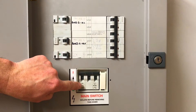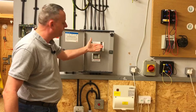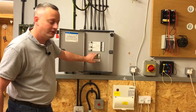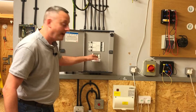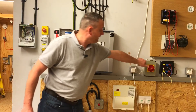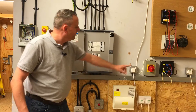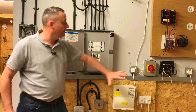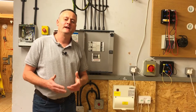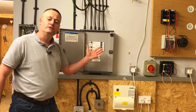We're going to turn off individual circuit breakers, reducing the current down so that when the main switch isolates, we expect current to be zero. We've turned off all of the devices within the distribution board, then we throw the main switch off-load — so there's no current going through it. As we have a remote switch away from the distribution board, we can turn that one off as well, and that's the one we're going to secure the isolation process on.